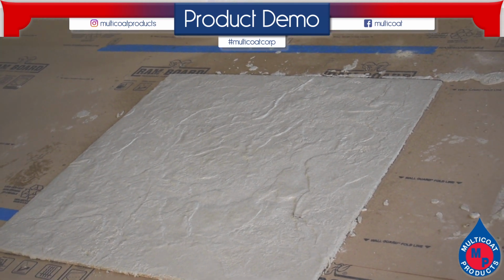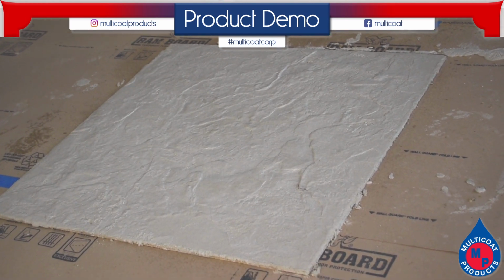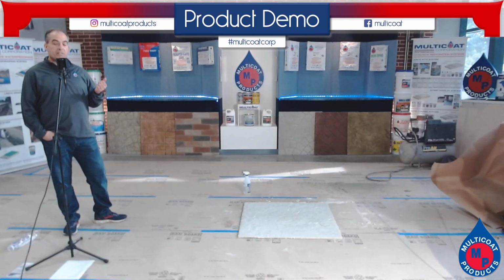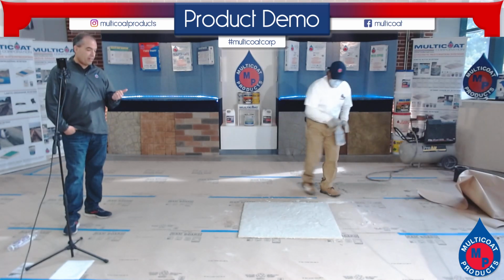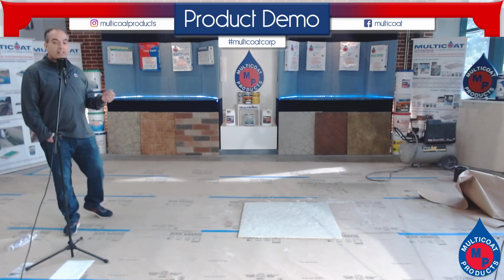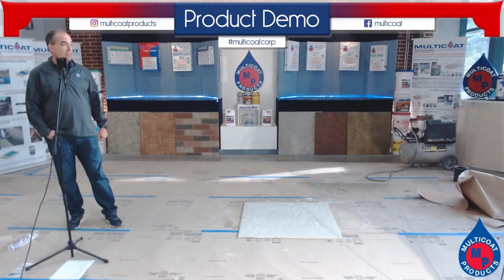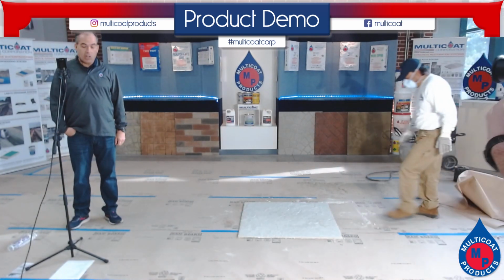And as you can see, stamp texture. It's fairly easy to do. Our stamp product has a fiber inside of it, if you ever look in a bag. And it makes it very hardy, very strong, long lasting. You can drive vehicles on it, no problem. A lot of our concrete overlays are good for parking garages, vehicle traffic, high impact areas. And you have a long-lasting surface.